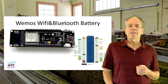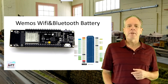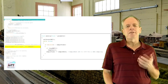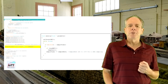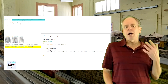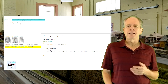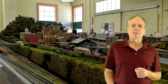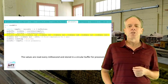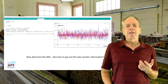I connected the sensor to an ESP32 board using the I2C interface — I'll leave a link with more information in the description below. I modified the sketch from my LiDAR sensor from videos number 33 and 35 to read data from the IMU. For this I created a separate task that keeps running so I do not have to call it from the main loop function — it is just easier for testing and controlling the timing of the readouts.